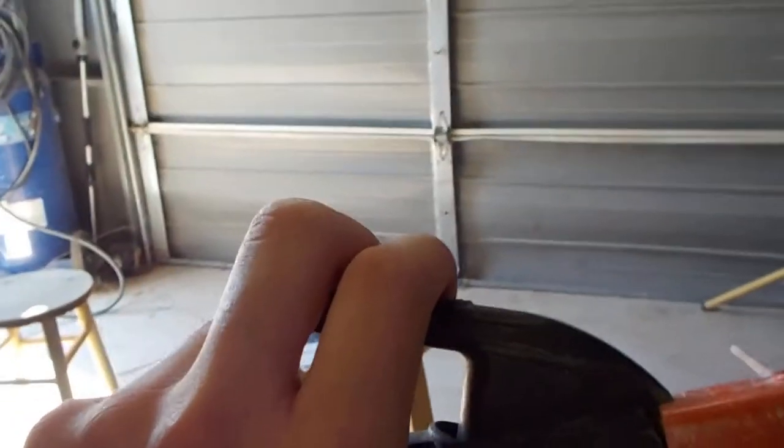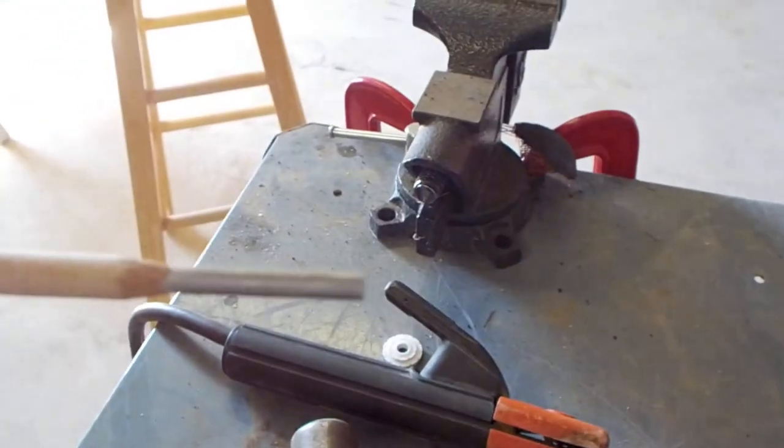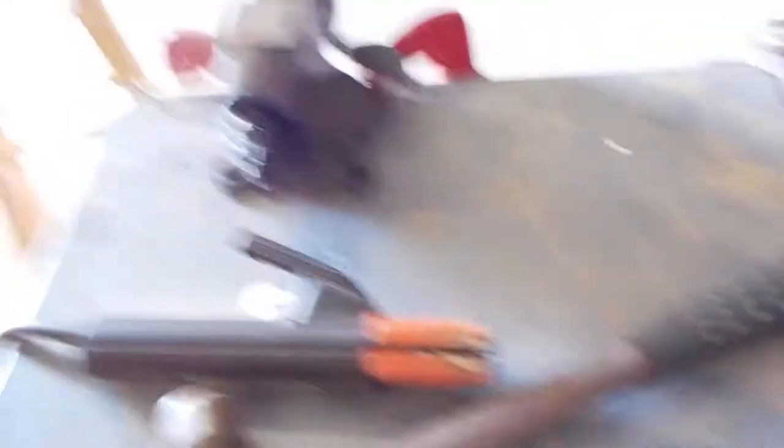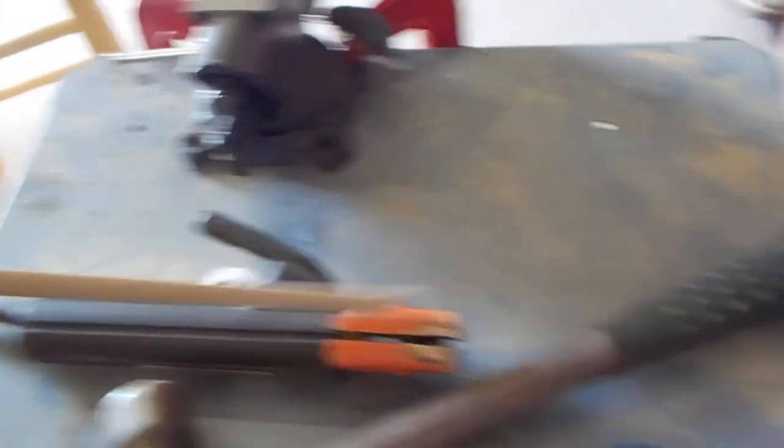What you basically do is - you see this little handle right here? When you're done welding, you just drop your electrode like that. This metal piece right here, the bare end metal, goes into our electrode - not the flux-coated end, or our brown or white-coated end. It does not go in there, or else you'll have some pretty bad smoke, and it's just not a good idea.